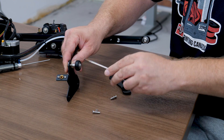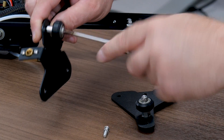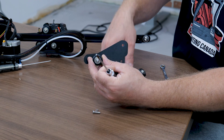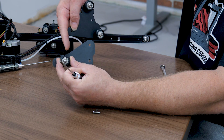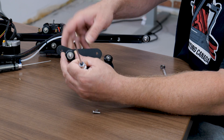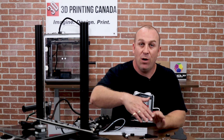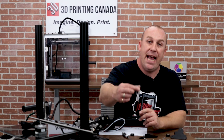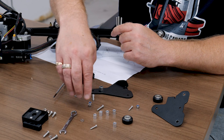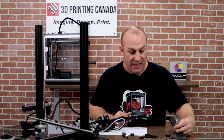Always be careful not to cross-thread things. Now our wheel with the eccentric nut — we want to make sure the nut is facing inward, so it's opposite of the other two wheels. That's the one with the eccentric nut. After you've dumped out all the hardware the kit provides, you're going to want to take the extra-long bolts they give you, because you'll need the three spacers they add in the kit to complete the assembly.